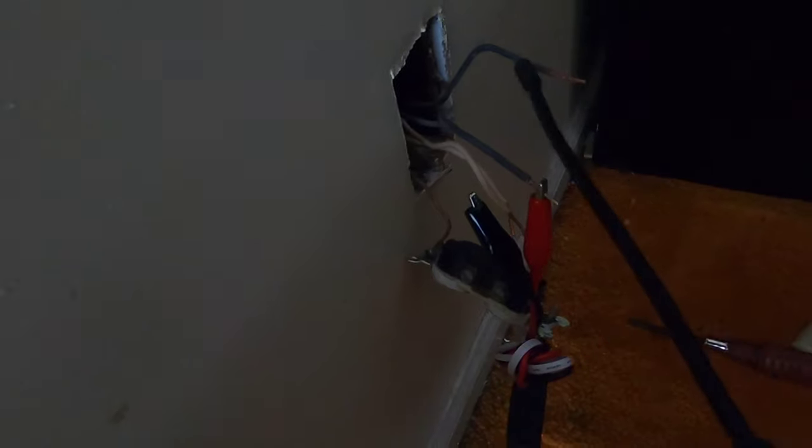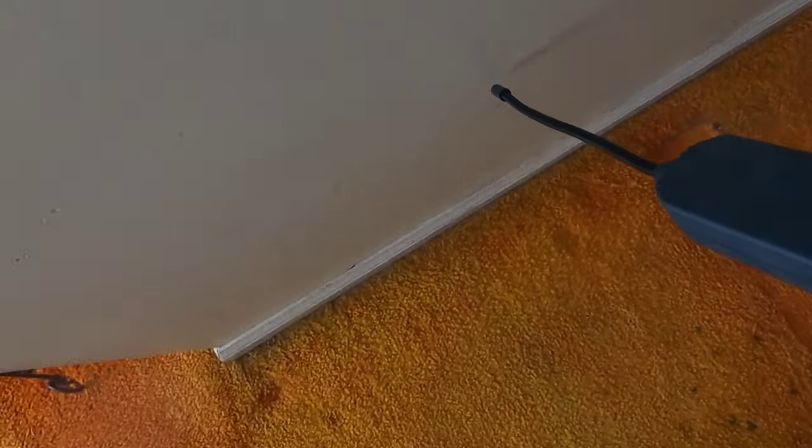Let's go take a look. This is in the dining room. This outlet was working — what was plugged in was coming on and off, there was a lamp connected to it. But we have two sets of wires here. The reason these wires are together is that after I pulled them out, I connected them and the lights in the other room came on. I also used the cable tracker to confirm which wire was which. Even though the signal died out on one end, you can still hear it. When I go back into the kitchen where the microwave gets plugged in, you have the connection — so now I know this outlet is connected to the one in the other room.